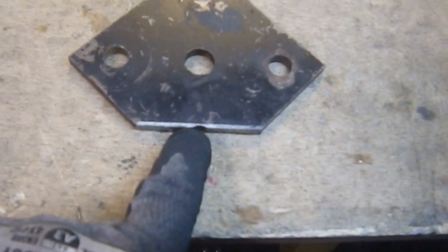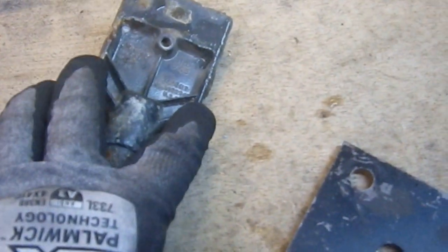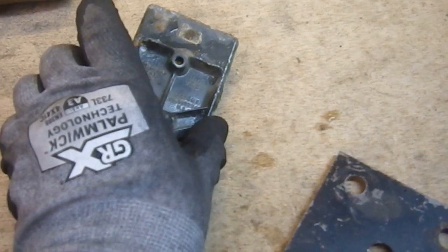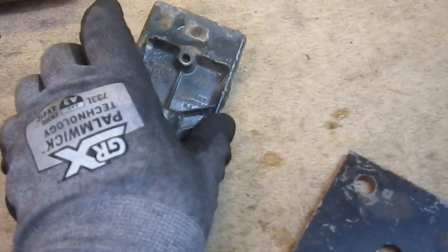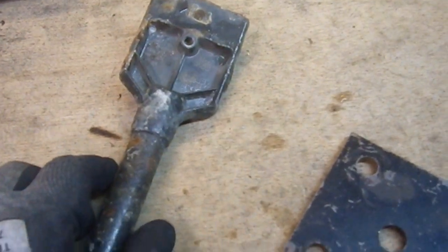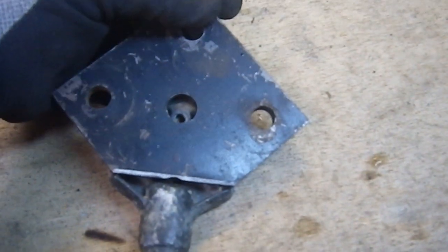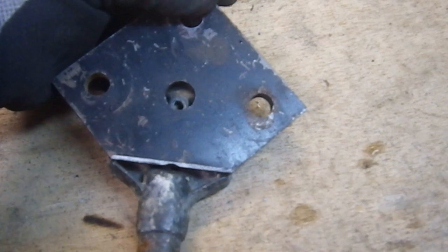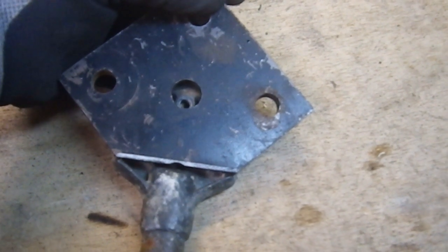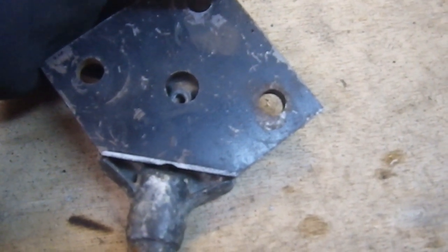So it was just beyond the hole, and this just fits now the width here. Oddly, this is 2.41 inches wide, so 410 thousandths wide, which seems like a strange width, but what the heck, it is what it is. So that now sits there, and as you can see, I'm going to be able to reuse that hole, which is a threaded quarter 20, which is awesome because I have lots of quarter 20, so I'll be able to reuse that with a washer of some variety.